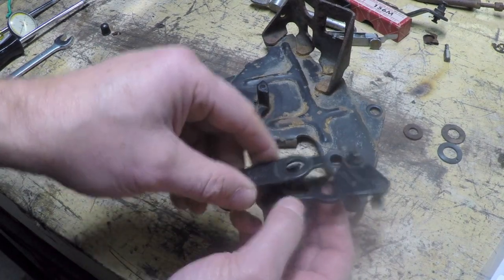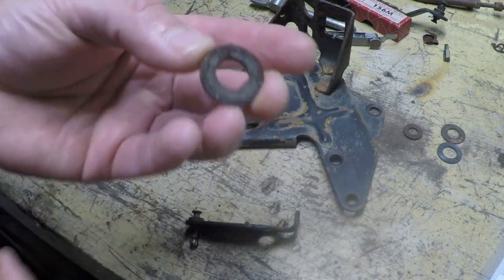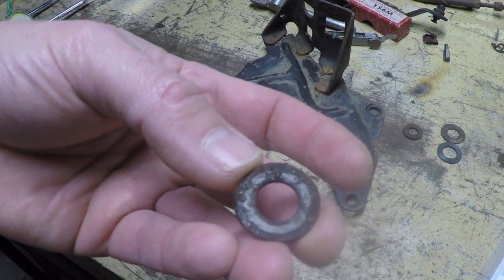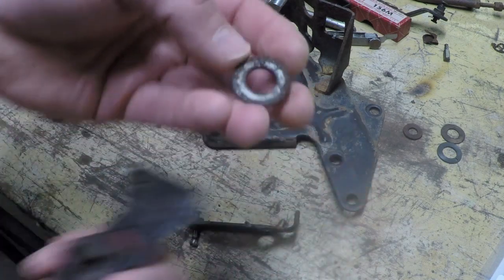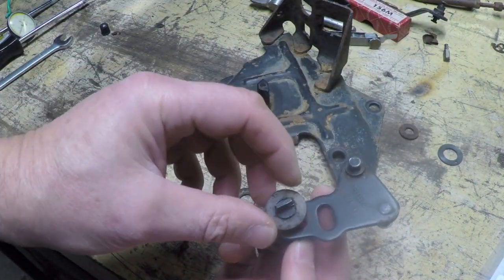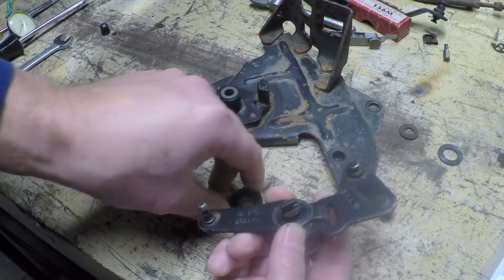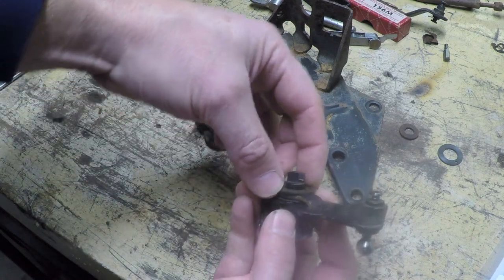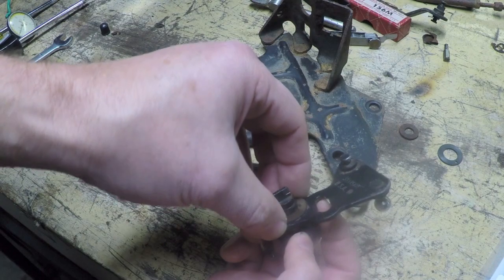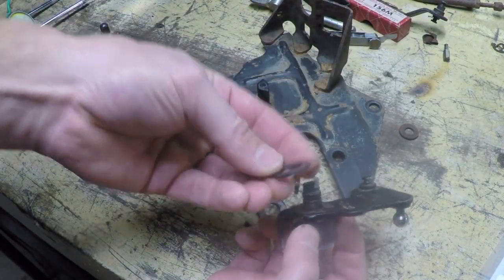I was able to hash out the details of the position of these washers. This washer — which I didn't clean yet — still has a ghost outline of the C-clip or outside retaining ring on it. So the nylon washer acts as a thrust bearing and goes on here first. Then this goes on, then this goes on, and then the clip goes on. That's critical enough that I can see there's no way I'm going to get this to go together with the slightly thicker washer.